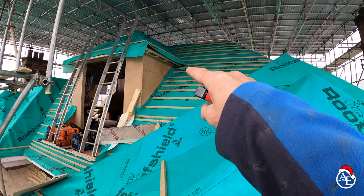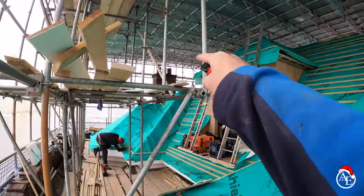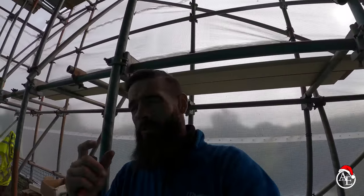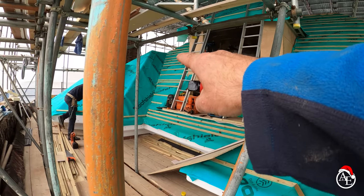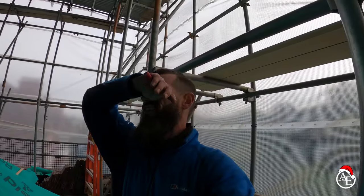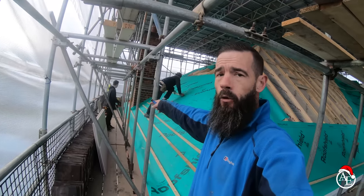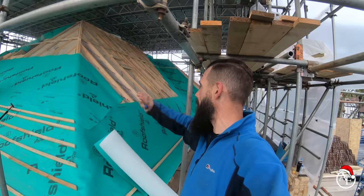The plan for this job so far — that bit of batten there has gone like that and down that side of the roof, down the front side and round the back, and we've lined it all up. It's about 20mm out over a span of about 3.7 metres, so over that span we'll have to open it up — it works out to about 101mm gauge. Today's plan: we're working on this section here first, then Connor's down the bar cutting batten. Once that section's done, we'll move on and smash that out.